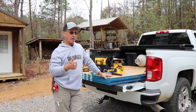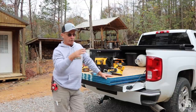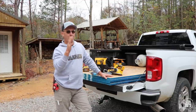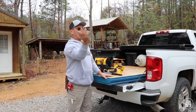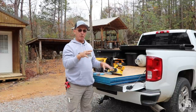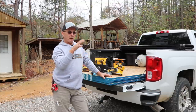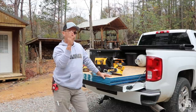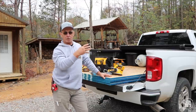And then my idea is, when I start putting the plywood down on the floor after I get the insulation in, I'll get some plastic. I'm going to go to that upper beam and drape it all the way around the cabin, and that will keep the rain from coming in on the plywood, and that will give me the opportunity to get in there, build my exterior walls, then stand them up and put them in place, and I can just leave that plastic up until I get ready to put the siding on.